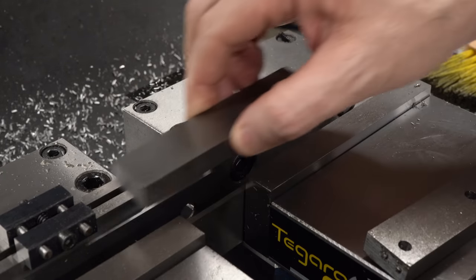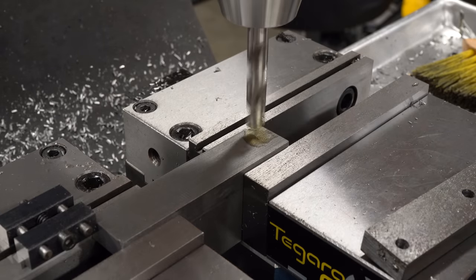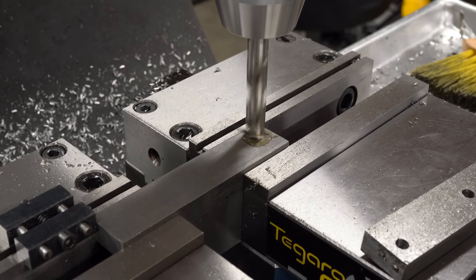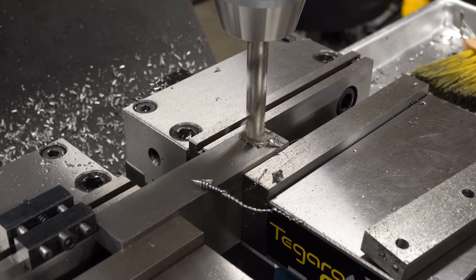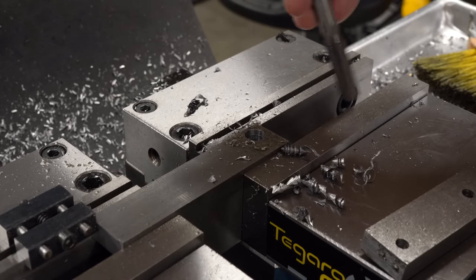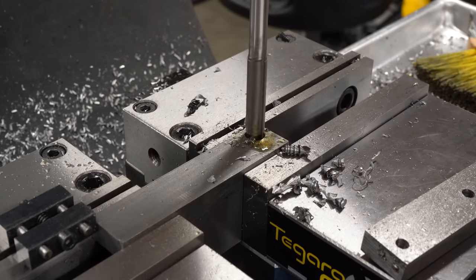The upper arm is similar but different - just similar enough to be confusing, so I keep checking the drawings. We'll start with the 7/16 inch hole in the upper right corner, which has a bushing for the cam to rotate. This is a larger hole so you really have to lean on the drill to make progress with no pilot, but it just went right through like butter. Now we'll come back with the 7/16 inch reamer - and this is where the problems begin.